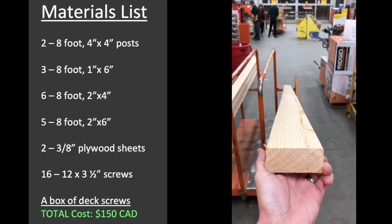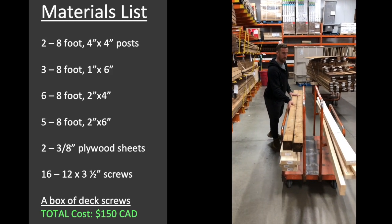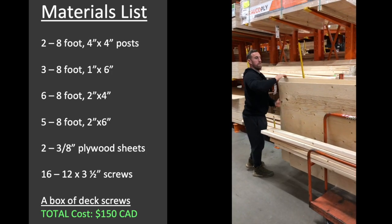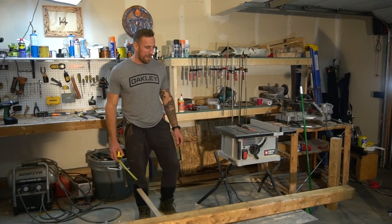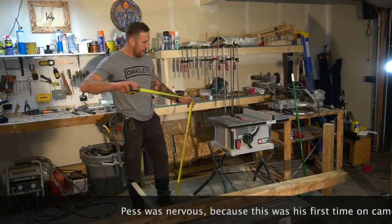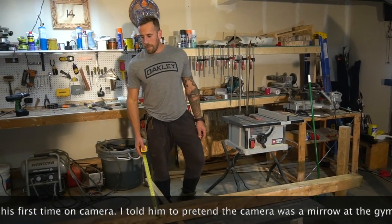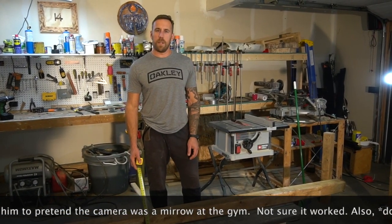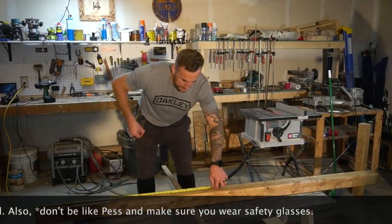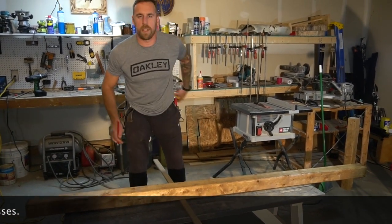You see how that curves to the left — you just don't want that. Tonight we're gonna make a workbench, and the top of the workbench we're gonna make level with the top of this table saw. The table saw is 35 inches in height, so you're not gonna cut your posts at 35 inches. We're going to put an inch and a half and three-eighths on the top, so we subtract an inch and seven-eighths from 35 inches — that brings us to 33 and an eighth. Cut your four legs at 33 and an eighth.